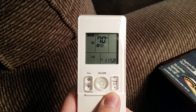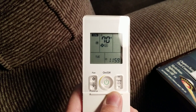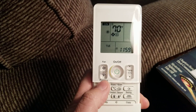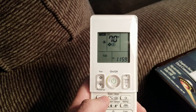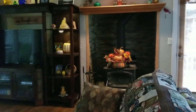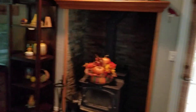You don't want to turn these off and on all the time — you want to keep them at temperature. With modes for ductless, we don't use the auto mode very often. If you cycle through, you'll see a sun and a snowflake which is cooling, auto mode, a dry mode which is a function of cooling to remove moisture, and then fan mode. For example, if these guys put this in fan mode, they can shoot that heat from the wood stove all the way down the hallway where we're already sending air.